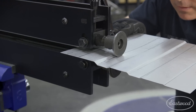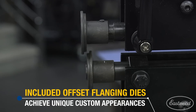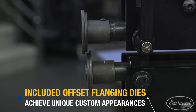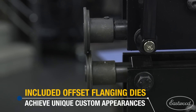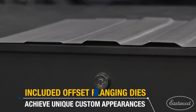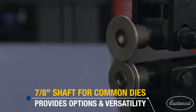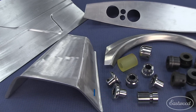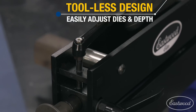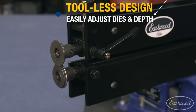The unit comes with our offset flanging dies, mounted on the standard 7/8ths-inch shaft. You can vary the distance and depth between these offset dies to fabricate a completely unique offset and custom appearance, depending on the look and function you want to achieve. The 7/8ths shaft allows you to utilize a wide variety of bead roller and flanging dies, as well as our popular forming dies. We developed this bead roller with a tool-less design, allowing you to easily and precisely adjust your tension and depth.